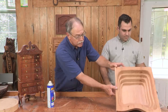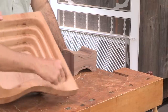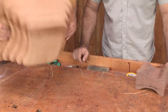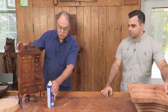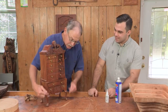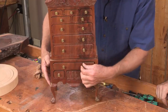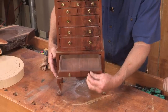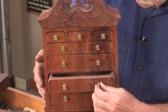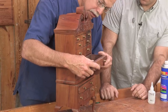This is one flat board that was an inch and three-quarters thick. I just tilted the table at three degrees, made an entry cut in the end grain, cycled around one after another, then glued it up. And there are other things you can do — this is actually three bandsaw boxes: a high boy, where I did a compound cut to cut out the ball-and-claw feet, and the drawers are done the same way — all boxes in themselves.